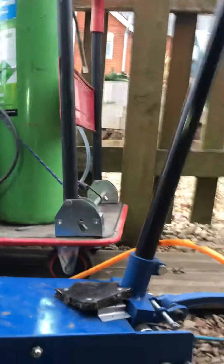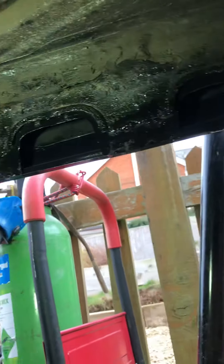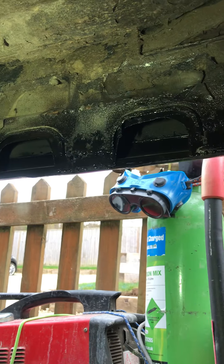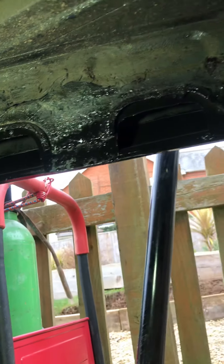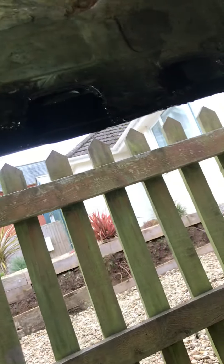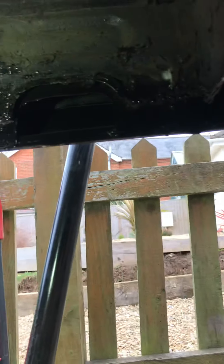Okay, John the van guy here, just thought to show you what's been happening with the sill attachment. I've used a cardboard template to cut in and make this back plate, which has a number of U-shapes in it. I've done it in two pieces and welded them in.